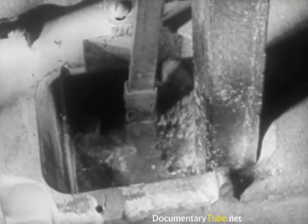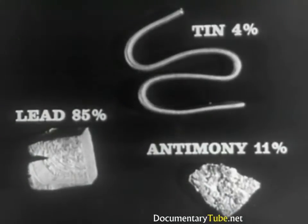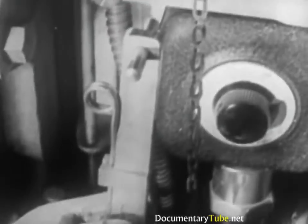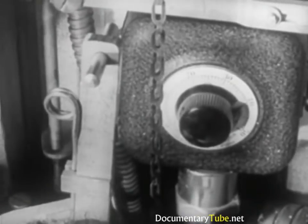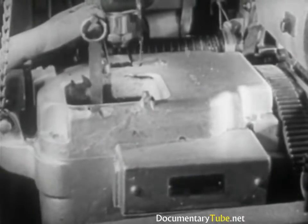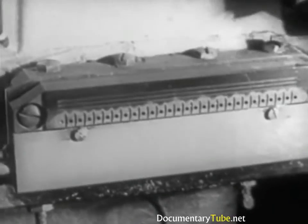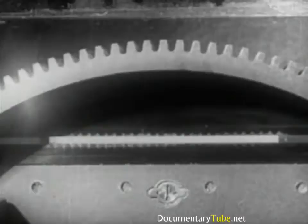This metal is a triple alloy composed of lead 85%, antimony 11%, tin 4%. The temperature for casting, approximately 285 degrees centigrade, is kept constant by a thermostat. The metal pot is always kept heated so that it is ready to cast slugs each time the mouthpiece moves forward and locks against the back of the mold.